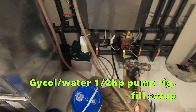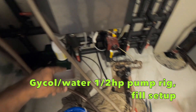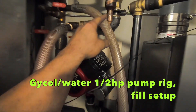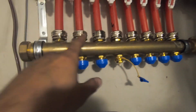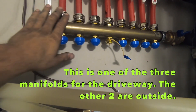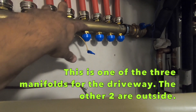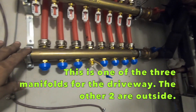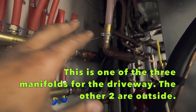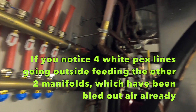All right guys, I don't put it on my snow melt loop — obviously I can't use that for a big loop, I'll just burn it out. So I've got this pump going in and going back. I'm going one loop at a time. I went from here on this loop and I close the others one at a time — open this one, then close that one — getting all the air out. Eventually I open them all up and let it run. Right now I have them all closed off and pressurized because I've aired them all already. I'm going to open them all up and let it run — it should be good.